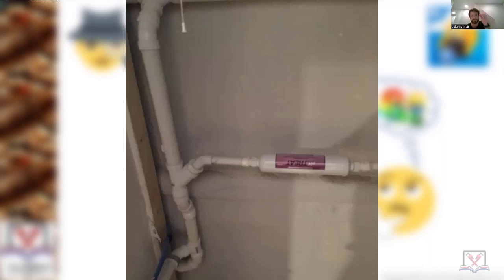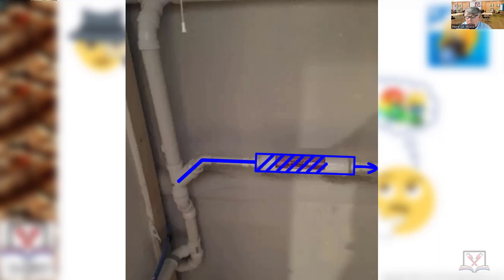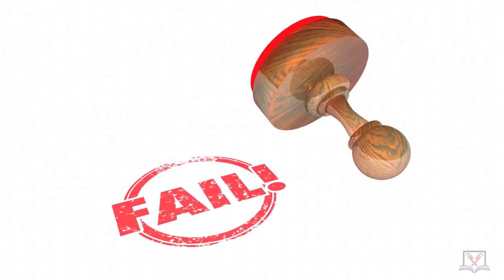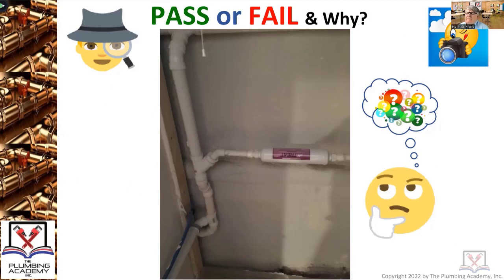It's completely connected - that's it. Sewer gas is able to come right up through whatever is in there. What would be in there? Limestone or marble - any of that kind of stuff. It needs to be maintained, or take that thing out, clean it out - take the old marble or limestone chips out and put new ones in every couple of years at least. Fail. Re-inspection fee. Just ridiculous, absolutely ridiculous work, and we see so much of it.